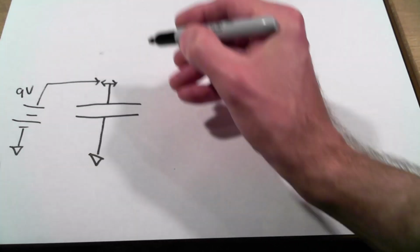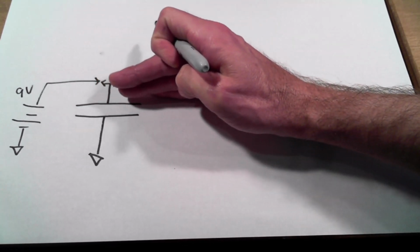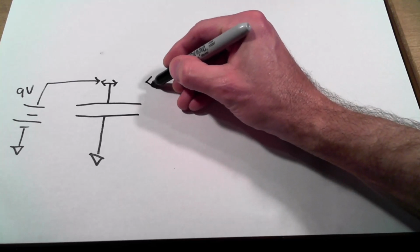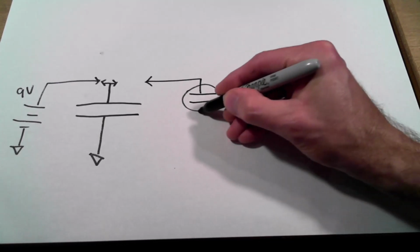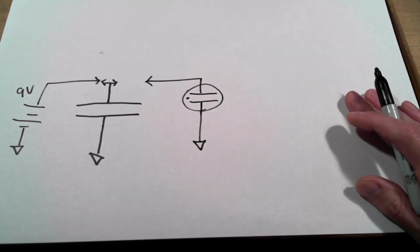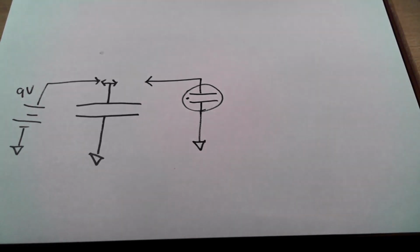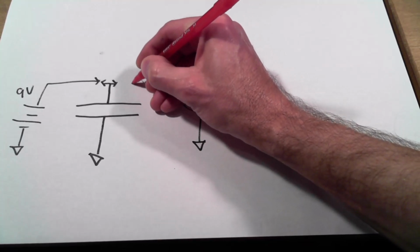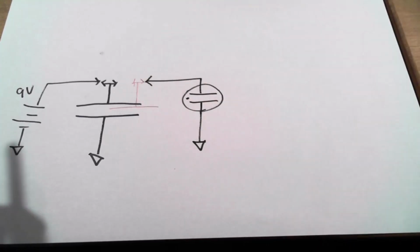and that's 9 volts. And then I have the ability to slide one plate of the capacitor, reducing the capacitance, and then finally I can make contact with another switch over here, and then discharge through my neon light, a little dot for neon, and this side is grounded here. Okay, so I charge at one capacitance, and then let's draw with red pen, I discharge at this other, lower capacitance, and so the plate has moved effectively here. Okay, so what's going on?